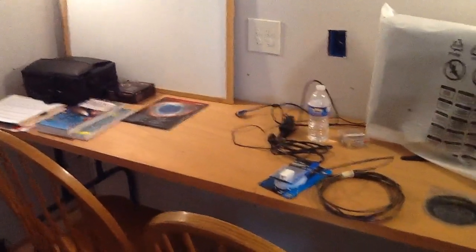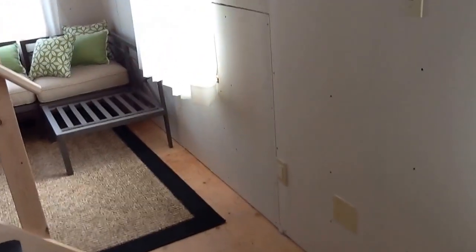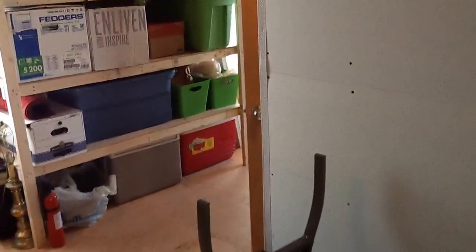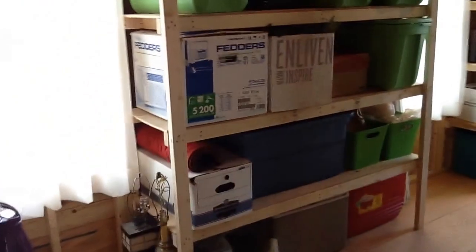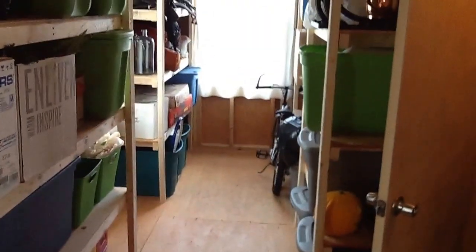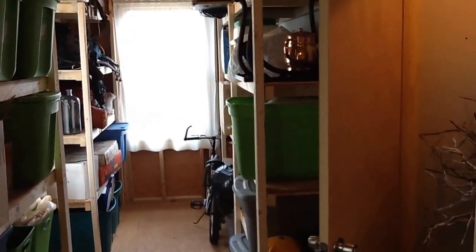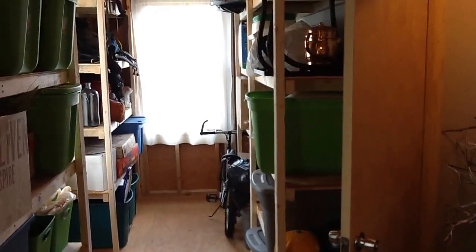In the control room, the lights are on a dimmer switch. It's well insulated and comfortable — I can do any reviewing I need to. All my outlets are on 20-amp circuits. I have three 20-amp circuits coming up here: one controls some lights here and on the other side with an outlet on the wall; another starts here with GFI circuits and goes up and over into the control room; and the observatory is on its own 20-amp circuit. Three separate 20-amp circuits — more than enough power to support this entire area. Hopefully I can put together additional, better videos to explain some of the things I've done in more detail, and what plans I have for the future. Thank you for your time.